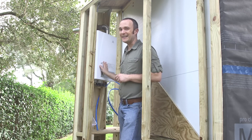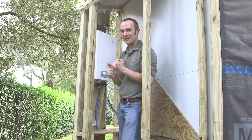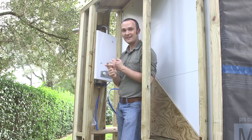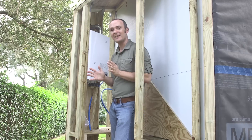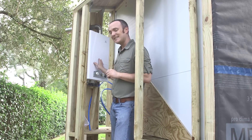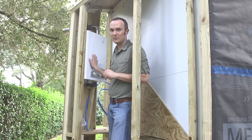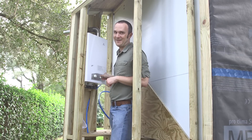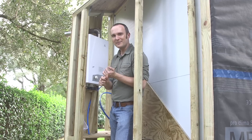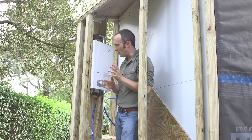We also only want to warm the water up a little bit, because I have one shower head that's going to be one and a half gallons per minute, and one sink that's going to be one gallon a minute — so a maximum of two and a half gallons per minute going through this. It's designed to have 75,000 BTUs, and it's one of the smallest ones we've got. Even then, I'm going to dial it way down because we only have to do a little bit of warming with a little bit of water.